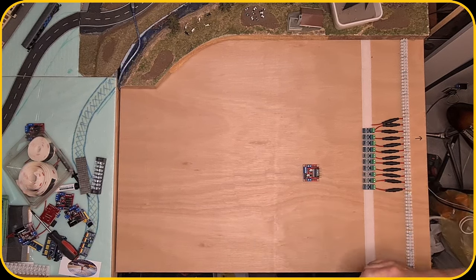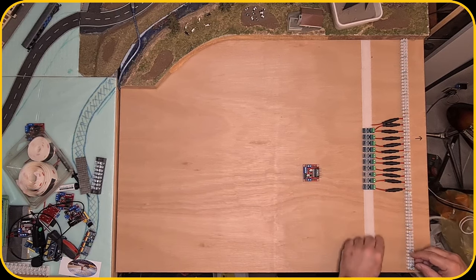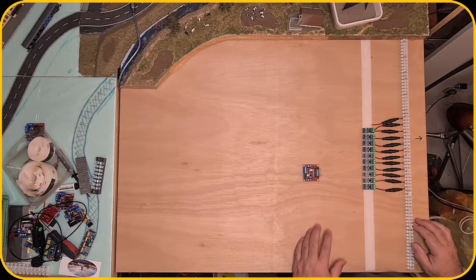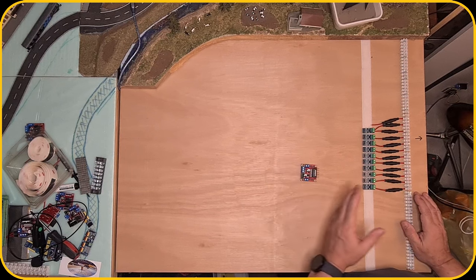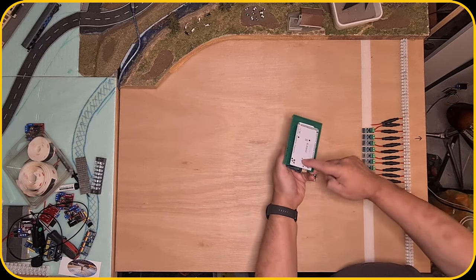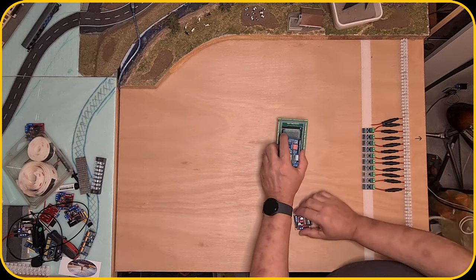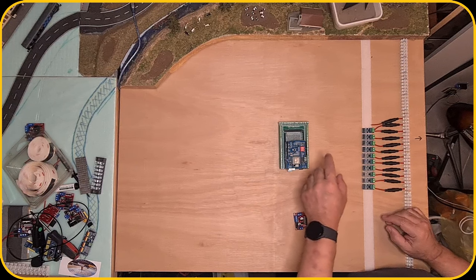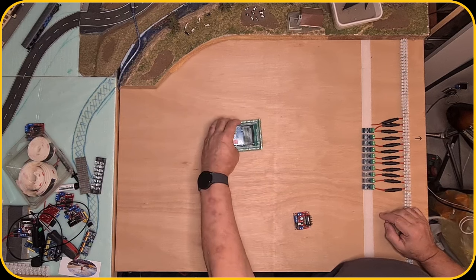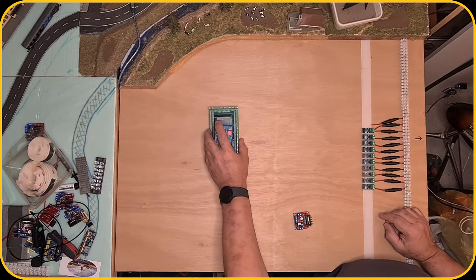So that is a challenge, of course. The wires will be twisted and then will go that way to fit in here, because they need to be connected to that. So that is one thing what I need to do. The other thing, I have the Arduino position here. So this is the Arduino. It's an Arduino Mega with a shield which has screw terminals on it, so I can easily connect the wires to it. This is the heart of my whole control board. I need to check where I would like to position these.